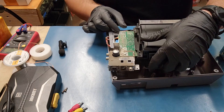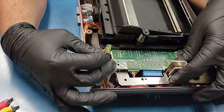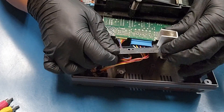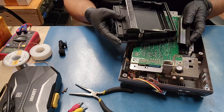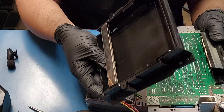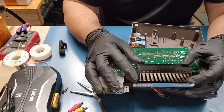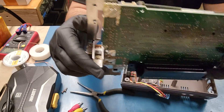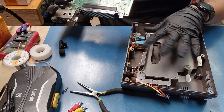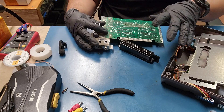You will need to remove the controller port and power supply connectors. The first one is right over here — that one gets removed. We have two more connectors right here that need to get removed as well, and you may end up needing pliers. Now that it's all in pieces, you can easily disconnect the cartridge spring slot. We've exposed the 72-pin connector, which looks to be in immaculate condition because we applied some Deoxit a while back. We'll also remove the 72-pin connector while we're here.